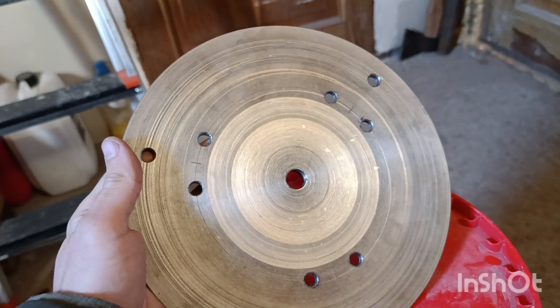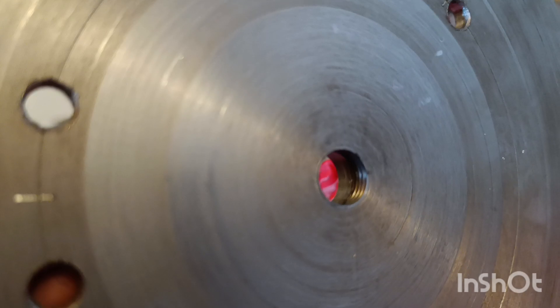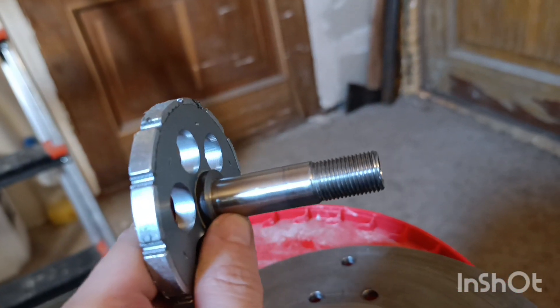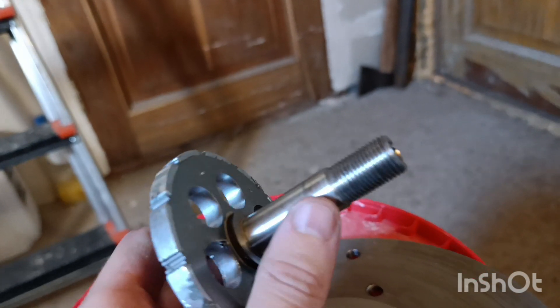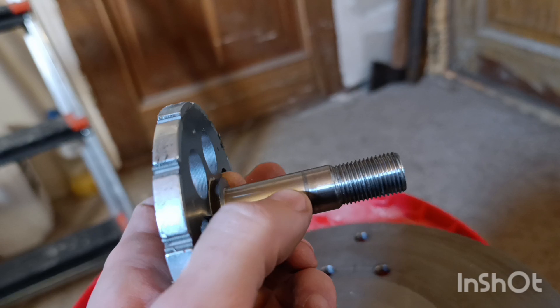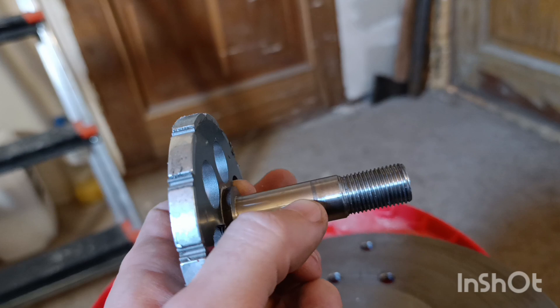The steel hub has the same holes and a really custom-made fitting to be mounted on the shaft — it has a thread that exactly matches the shaft on the generator. It has a neat and nice seating place. With the shaft itself — I have this piece of the shaft from the generator, like the same one that is on the wind turbine. I want to screw it down to the very bottom; it's threaded as well, but it has to not only sit on the thread — it has to sit at least one centimeter on this piece so it is tightly connected and really has the balance.